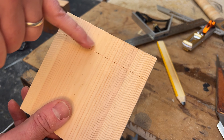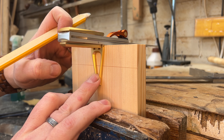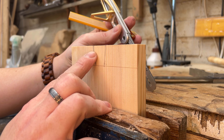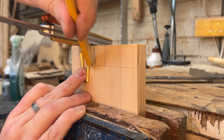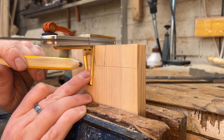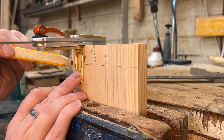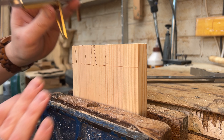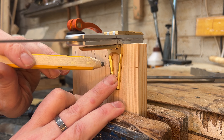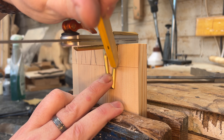Now we can mark off where all of our dovetails are actually going to fit along there. There's the tempting option to just put the jig in the middle and draw up both sides, but of course you might not always want a dovetail that wide — you can mark one side and move it over to create a thinner one. One of the beautiful things about doing dovetails on handcrafted furniture is you can make up your own patterns that become exclusively yours. So maybe on this one we can have a 6 to 1 ratio as a centre dovetail and then an 8 to 1 ratio on the ones on the sides.